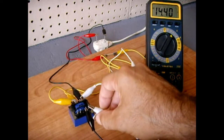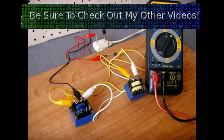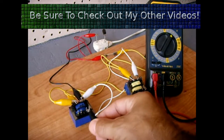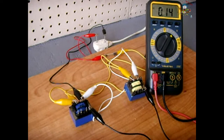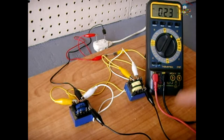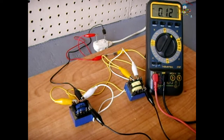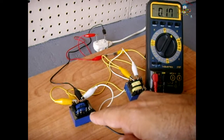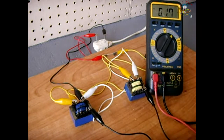The next thing is connecting them in parallel — it's very important it's done right. Connect one only on that side. You're not going to want to connect the two together until you check with your meter. To confirm you've connected the secondaries on the right terminals, use your digital multimeter and measure the voltage between the remaining pins. The reading should be zero volts or very close to it if your transformers are nearly identical. The most you should see is the difference between the two — I might get maybe 0.4 volts if I'm on the right one. Let's try it.